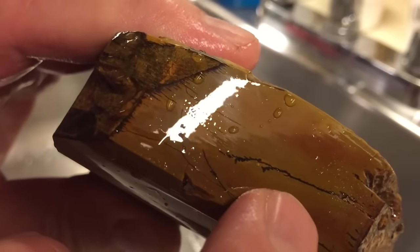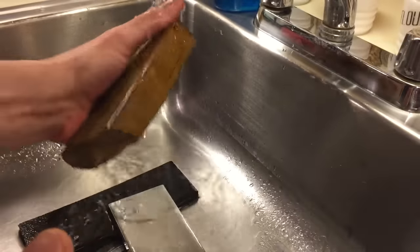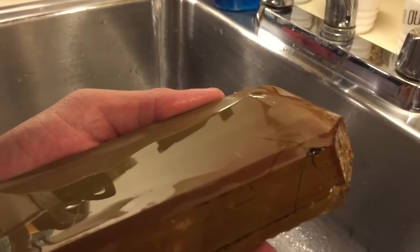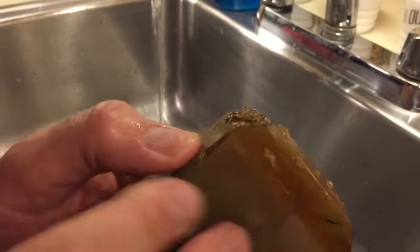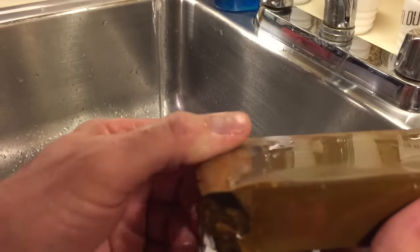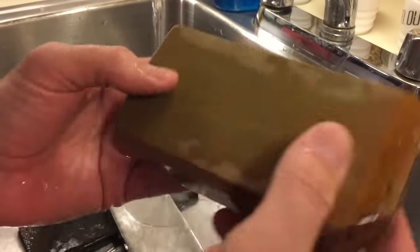These are a little bit more than your normal hairline or suji. It's an inclusion — it's soft. It doesn't interfere with honing. And I kind of actually like these little character traits in stones because it gives it its own little personality. We also have to be careful because sometimes you can split a stone on that seam a little more easily than you could elsewhere. So I sealed down here, lapped, and rolled it off on the end to relieve some of the distractions. I didn't want to lap down and lose all of this stone, because that would be a waste.